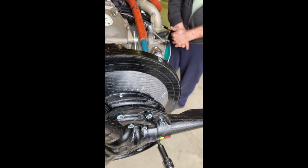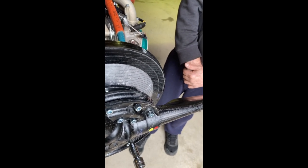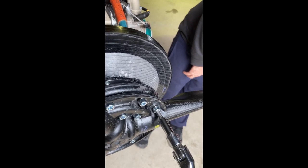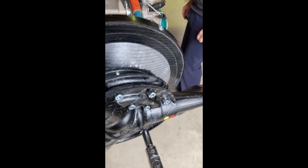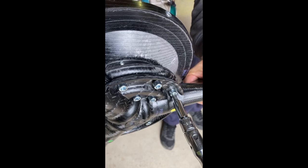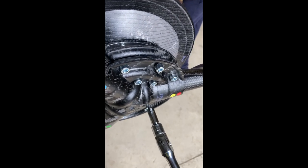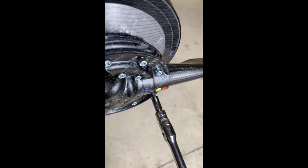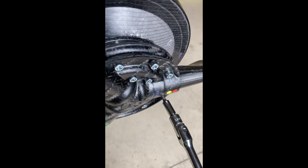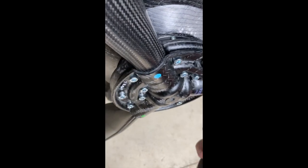And depending on how you do the screws up, that will change. So if I put more weight to the bottom, that usually increases the pitch a little bit, or you can put more weight to the top. Yep, 25.2. Is it still? Yeah, 25.2. No, it has to come back a bit. Yep, that's it now, 25. Supposed to be 25.1, but Danny doesn't want it pitched quite as much. No, it's 24.9, yeah, which is what the other ones will be. They've got to be within 0.1 of each other.